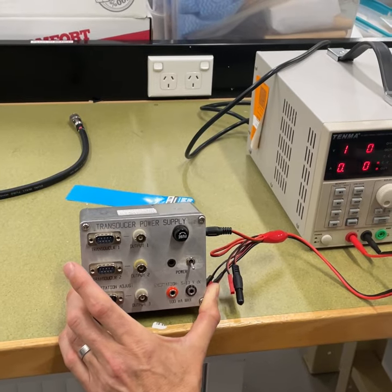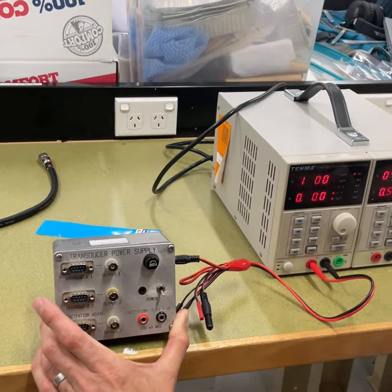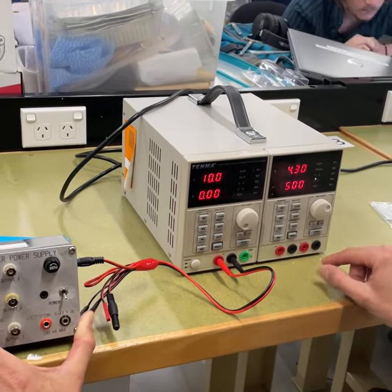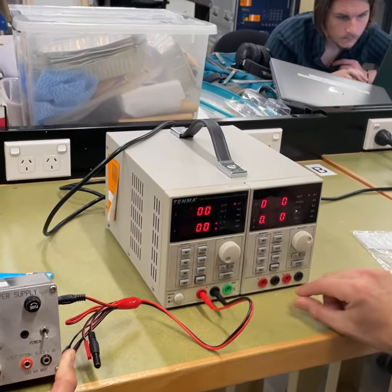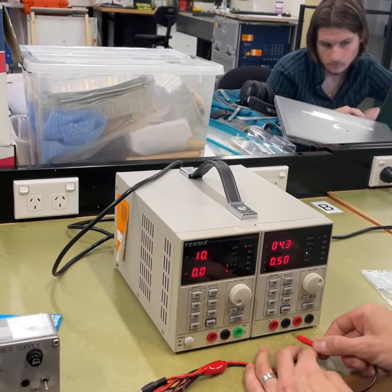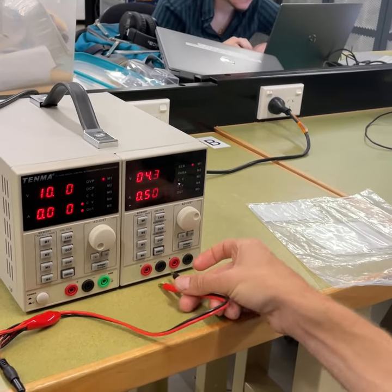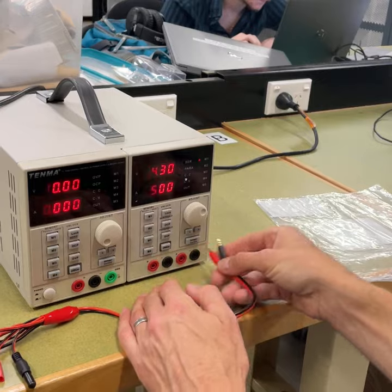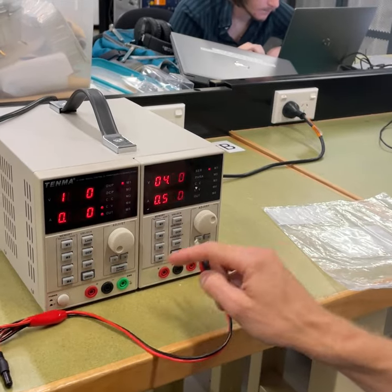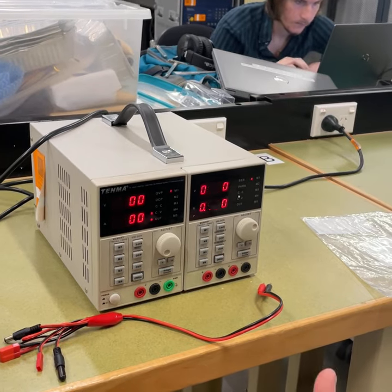You can use different configurations here to get plus or minus 10 volts. If you need plus/minus 10 volts, you might take 10 volts from one side and minus 10 volts from the other by connecting the cables in an opposite sense. There are various different configurations to achieve plus/minus 10 volts using multiple channels, but those are advanced skills.